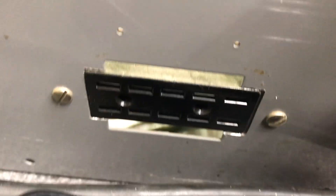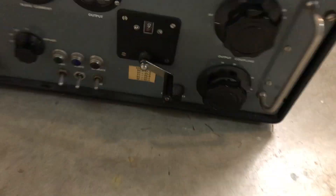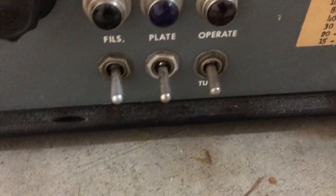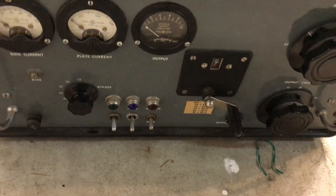He could not find the cable that goes with this — a Cinch Jones 10-position Jones plug. I did find two of those on eBay, the male end, so I ordered those and I'll make up a cable. What those do is connect over to the amp in the back, bringing all the connections for things like plate, filament, and operate — these actually control the power supply functions from the amp so you can have the power supply located remotely. I've got to get back on eBay and order a female 10-position Cinch Jones connector. But anyway, I think we're on our way to getting this baby fired up.